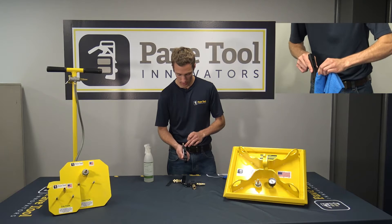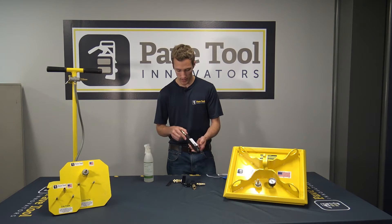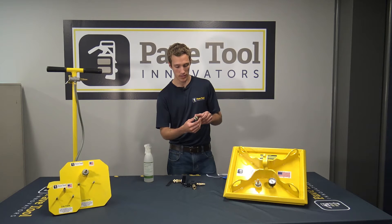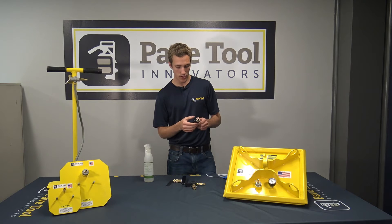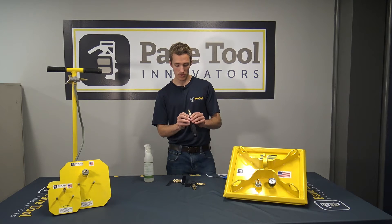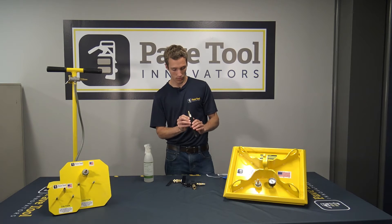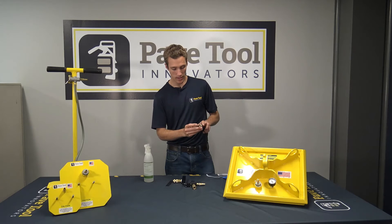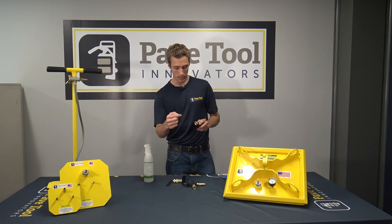Another thing to keep in mind is that there is always a possibility of a piece of stone or something getting into the small hole that actually creates the venturi effect. It comes in through this very tiny hole and then the product opens up. You can actually look through and see light through the venturi — if you see light, that's a good sign. If you don't see any light, that hole might be blocked off. Just get a small pin and you can clean that hole out.